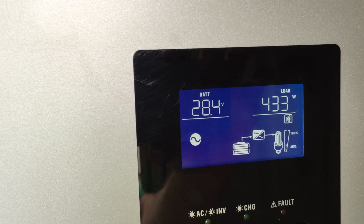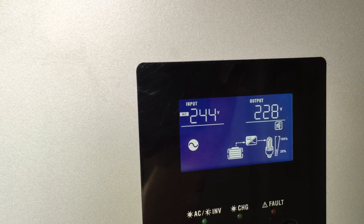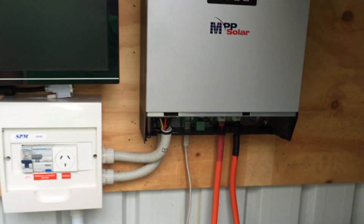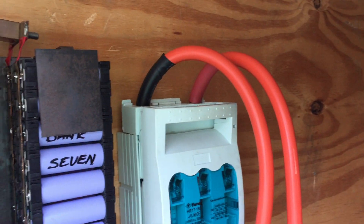The house is using 430 watts. We've got the inputs at 240 volts and that's the output — because we're on battery — oh my god I'm happy. Now I've got a bunch of stuff still left to do: the cables. I've got an enormous amount of cabling just laying on the ground because the 24 volt work I can do myself. It's going to go through those two holes up the top; I've got to do some conduit and then it'll come through the top and down and around so it all looks pretty.